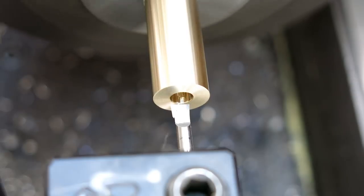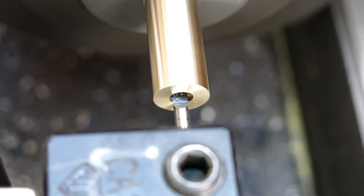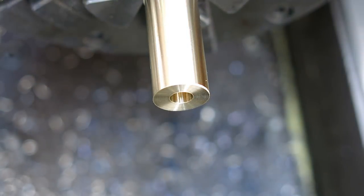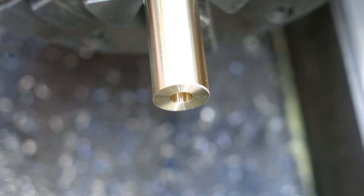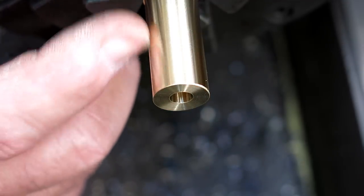So I think we're ready for our finish pass. I'll back it up and drag down the bore. Oh boy — that's right where I want it. It's two tenths under. I think we're just going to leave that. We're ready to go over to the mill now and cut our 0.4 module teeth in that.